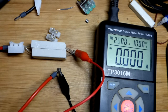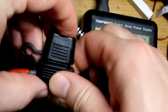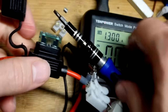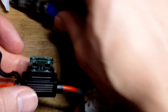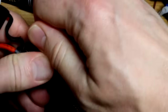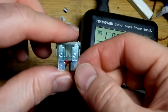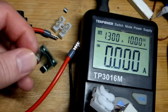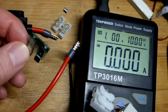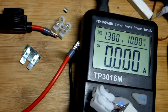We got way above one amp, which does not look good. I was never able to get it to snap all the way shut, and I had to kind of wiggle and pry to get it off. The fuse feels like it's in there pretty good, but there are charred marks on there. The fuse did blow, but it took a lot longer than I think it should have. I don't use a lot of fuses, so I don't know if it has to be high current for a little while — there are slow-blow fuses and such — but in any case it doesn't look like it blew as early as it should.